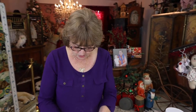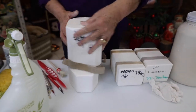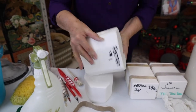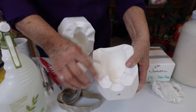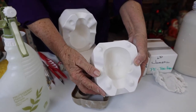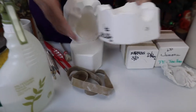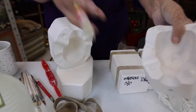I store them outside, but when I pour a mold I leave it in my heated pour room and let them dry thoroughly before putting them back out. Mold care: I unbanded them. I always store them vertically. When I take the bands off, I do it this way — I do not turn them this way, because that will cause breaking. It will cause your pour to pop out and be a blowout, creating a bubble that's harder to clean. Take care of your molds. When you put them together, don't slap them together — put them together flat. While it's open, always clean your molds.